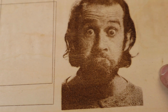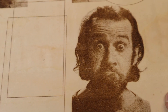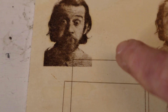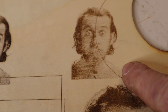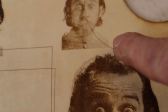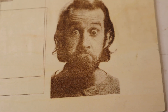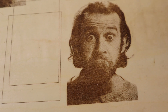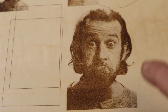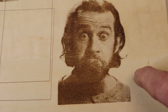This machine is fast. This is one of the engraving tests I ran — I did a couple at different speeds and different powers, and I think this one came out about the best. A couple more with some Carlin imagery, because you can never have enough Carlin. That one was at 100% power, which was probably even too dark. Running it a lot faster caused it to break down a bit, so I think there's a sweet spot in the middle. One thing I want to point out is that image quality has a lot to do with how your final engrave comes out, so don't always blame the machine — a lot of it is about image prep.